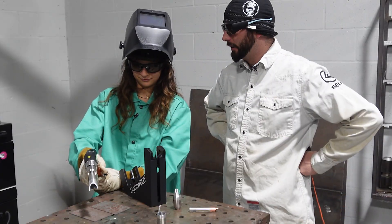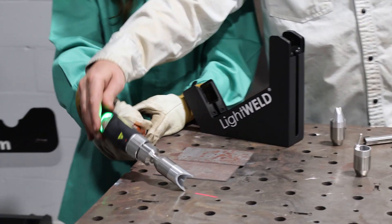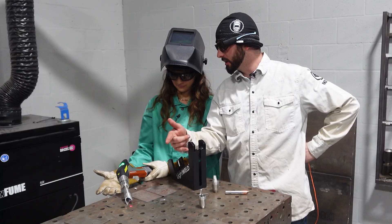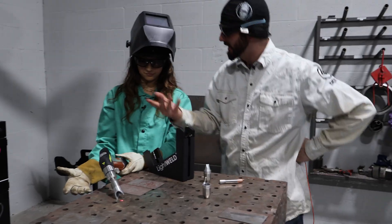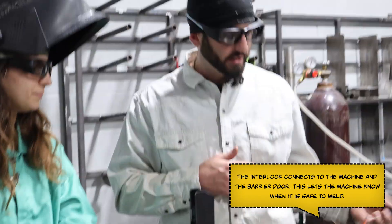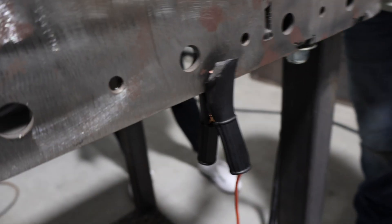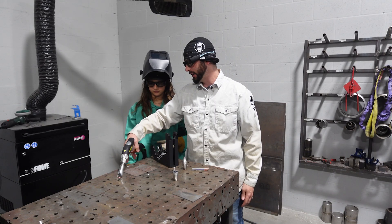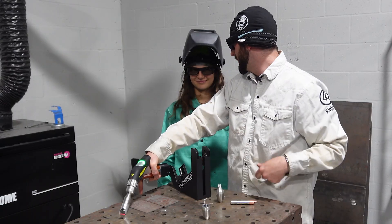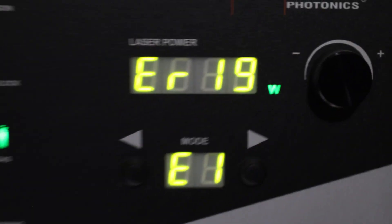Go ahead and try to pull that trigger and get going. It doesn't work. See the screen light on the top? This goes hand in hand with our double trigger system. So if we hit that bottom trigger, you'll notice that gas turns on for us, and then we hit this top trigger, and that's supposed to give us our laser action. We can't do that without this interlock system — this is almost like a ground. We've got to have that on our material or workpiece. Now when we hit that first trigger, you can see that this is blinking, telling us that we're ready to send it and do our laser business.